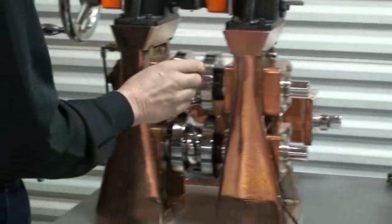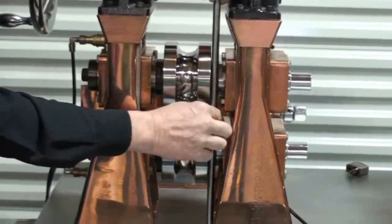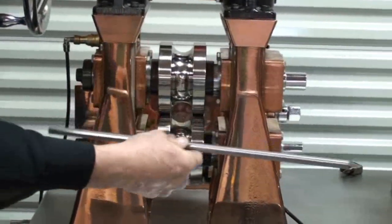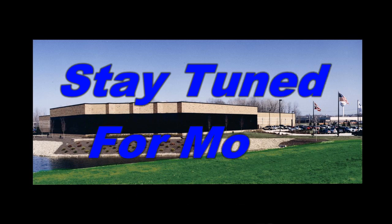For those roll spaces that are very tight and narrow where we don't have a lot of room between the roll and the bearing block, we can simply use a drill rod for a straight edge. It makes it very easy to get in there and do the same job as explained earlier. To check the accuracy of a drill rod, simply roll it on a flat surface like a ground plate to make sure the accuracy of the drill rod is maintained.